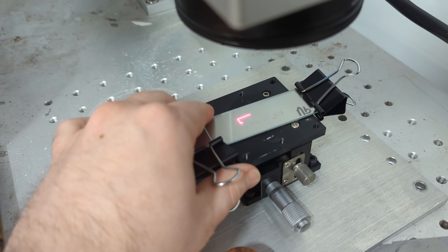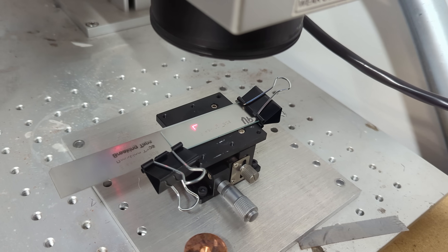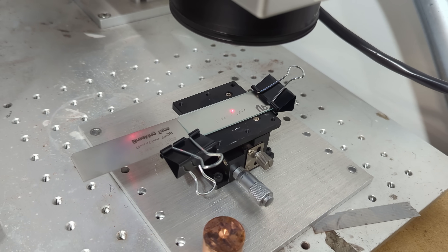This is actually one of those happy little accident techniques. I was attempting to weld together thin sheet metal, like shim stock foils — it works, but it wasn't very consistent, so I was trying to improve the consistency and reliability of the welding process. I tried clamping the shim stock between two pieces of glass, just glass slides, and the idea was to help improve contact between the metal by squeezing it together.